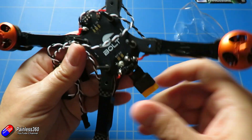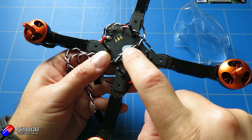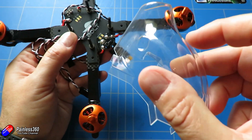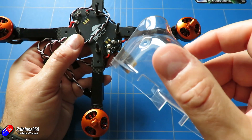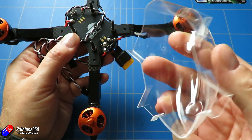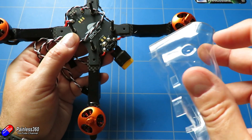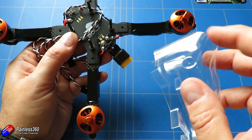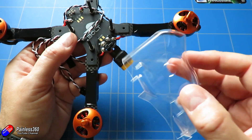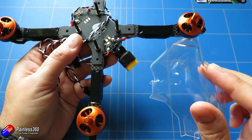Join me in the next build video where we're going to get the flight controller and the FPV transmitter installed and make the holes in this canopy. You'll need a sacrificial soldering iron tip for that — you don't want to be drilling the polycarbonate because of the risk of micro cracks. If you did drill it, you'd also need to melt the edges with a soldering iron to stop any micro cracks propagating in the event of a crash or from vibration. In the next video we're going to put all the electronics on and do all the soldering, then take it for a fly.